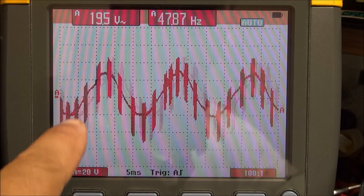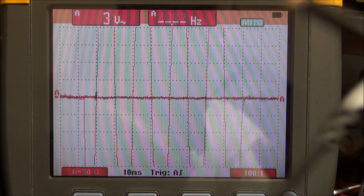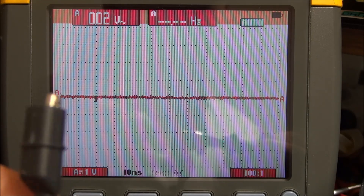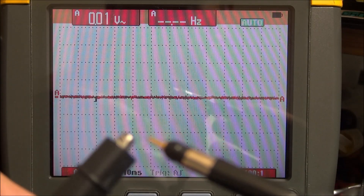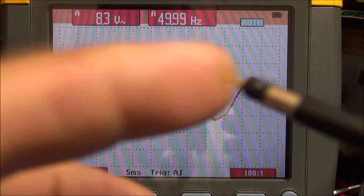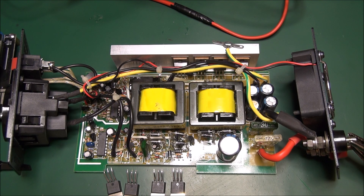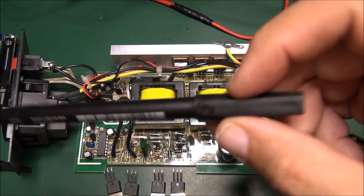This undulation in the waveform comes from the fact that I'm only using the probe tip and not the ground clip, because at this output there is no real ground — what we call in French a 'masse flottante' (floating ground). With this kind of scope you can just detect the signal without connecting the ground anywhere. The output gate signal here to recreate the output square wave seems to be okay.